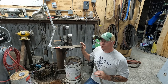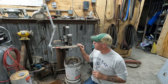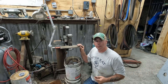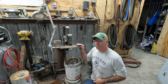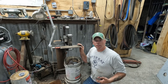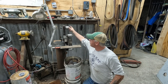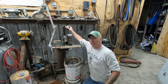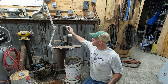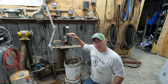It's been good, but we can do better. I've learned quite a bit more since I built this, and I came into a bunch of good heavy steel so we can make an industrial-strength 2x72 belt grinder with a lot of weight. I also now have the means to mill some things and get our tolerances tighter, so we don't get issues like that right there — that actually throws us off quite a bit. I put shim stock in from time to time and it still works its way out, leading to uneven wear on our aluminum guide wheels.